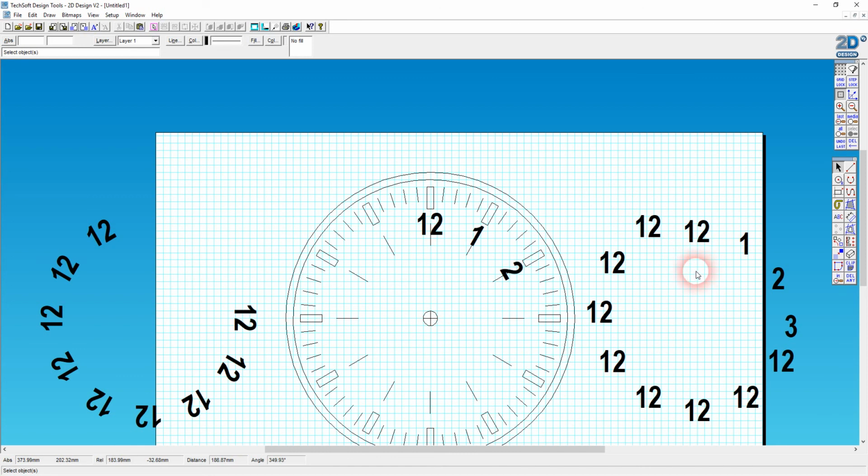So we're almost there. Don't forget, of course, that in order to engrave on our setup that we have in this institution, black fill engraves, but black lines do nothing. So what I'm going to do here, I'm going to shift select all my numbers, and then group them together for simplicity, and then move them to the side. Careful, look, I haven't turned off the attach tool and turned on the gridlock. So escape key on the keyboard, attach off, gridlock on, selection tool, et voila.